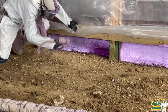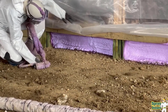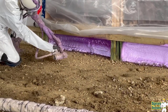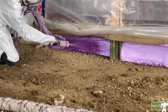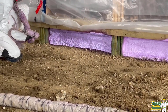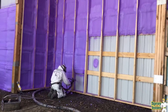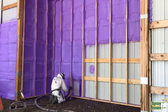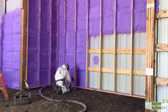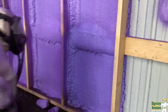It's no different than pouring concrete, mixing thinset for tile jobs, or managing how much paint you roll in a day — there are lots of practical applications where you work at a certain pace. The spray foam is no different. It's not that two inches is the absolute limit and two-and-a-quarter inches is a problem. You really need to get well beyond three or three-and-a-half inches — basically nearly double — putting four inches on when you should have put two. That's where you start to run into problems. The safety factors for the foam are fairly generous, but there are people who always want to test and go way beyond. The biggest areas where you run into issues with too thick too quick are tight corners — joist stands, connections, blind corners.